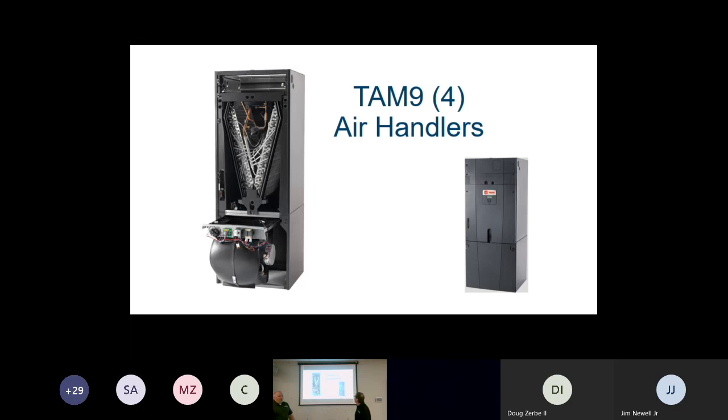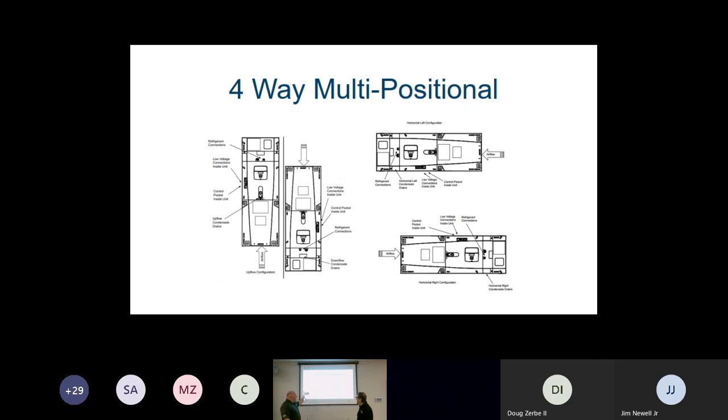Yeah. Well, and one of the things we're going to mention too is because this is a positive pressure air handler, it is going to be normal now to feel a little bit of air coming out of some of the gaps on the door. And that's normal. This is meeting the requirements for minimal air leakage. The biggest difference is because it's positive pressure, we can actually feel that leakage, where before on the negative pressure air handlers, you can't feel the leakage. You can't see the dirt and everything that's going in bypassing the filter, where now everything is actually going through the filter. Maybe we have a slight leakage of air coming out, but it's not going to cause harm to our system.